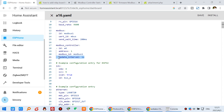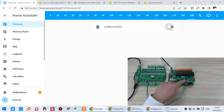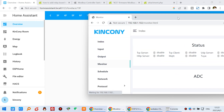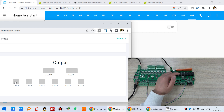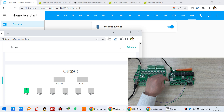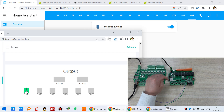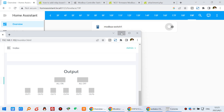You can see in Home Assistant: I can use this web page to turn on and turn off — no problem. If you use this way, you can see I can use this monitor and control it via the web page, or maybe by your mobile phone, or by your wall switch. I can click on and click off — this is not by Home Assistant, just by this web service. I can click on and this will update the state to 'on'. And I can click off — that is 'off'. If I click on to turn on, you can see the monitor is also turned on. So that means every one second it will update the state from the A6 board. This is very important for updating your state.